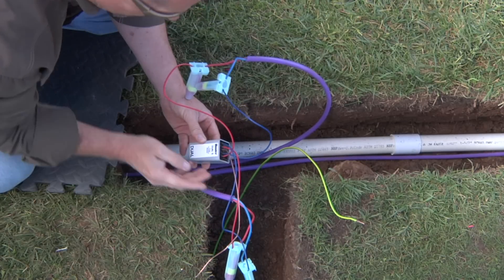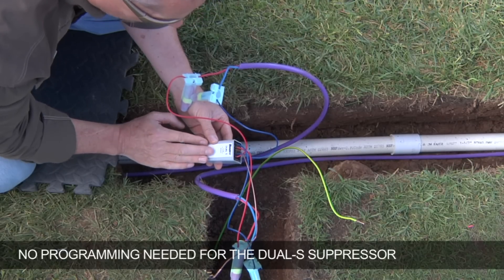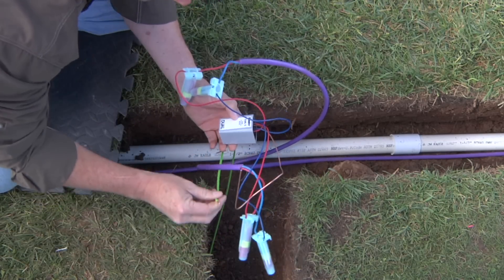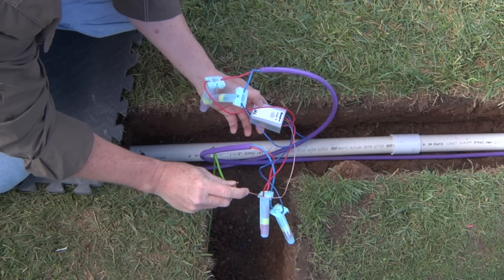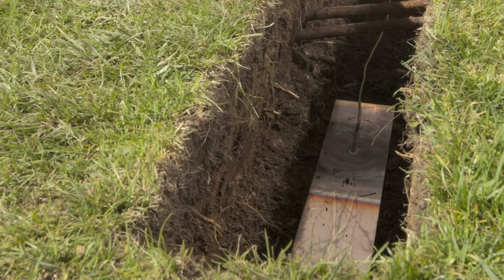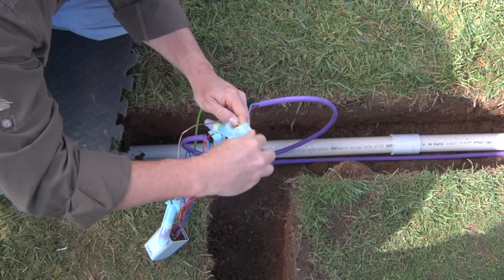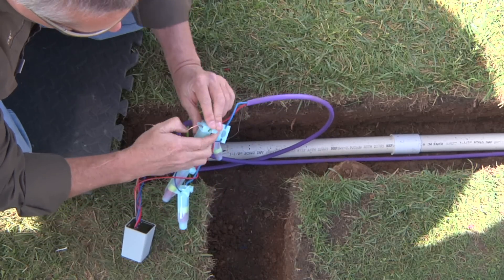That leaves us with our copper grounding wire. Remember, this dual-S does not need to be programmed at the controller — it contains no station information and does nothing to do with station operation. It simply is a way to ground your two-wire path to appropriate grounding hardware. We've brought in the green and yellow wire and this attaches to our grounding plate. The plate we'll be using is 36 inches in length, or one meter, and it's buried at 30 inches deep, which is about 75 centimeters. We'll use the same DBRY connector to attach the copper wire from the dual-S to the wire that goes to our grounding plate. We'll repeat the process: install the wire nut, assemble the connector, send your two wires out the sides, and snap it shut.